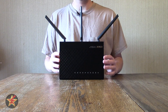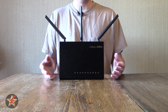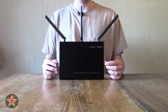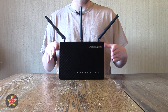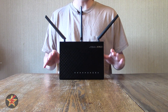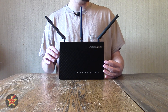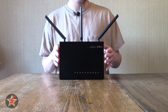So you're probably considering this Wi-Fi router because you're looking to step up your current network. Maybe you're future-proofing, because this is an AC router — that is the new wireless standard. It is also a dual-band router, being both 2.4GHz and 5GHz, putting both those signals out at the same time. The AC1900 rating that this particular Wi-Fi router gets is a little misleading. Really what's happening is on the 802.11n or 2.4GHz band, you're putting out a maximum output of 600Mbps.